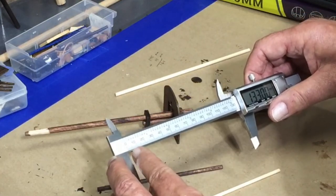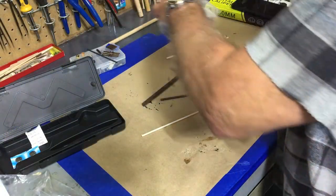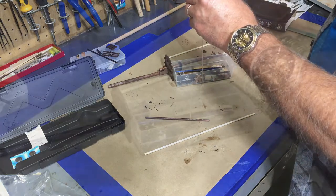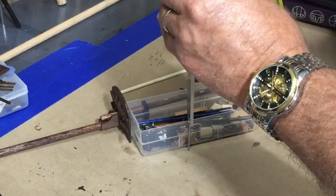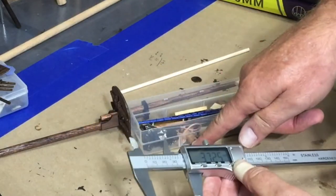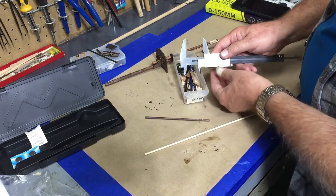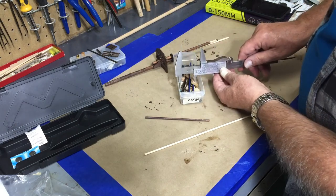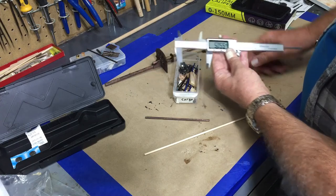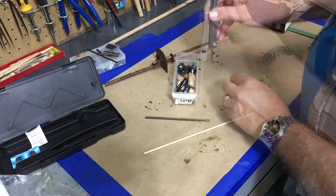The readings are easy to see — it gives the tens and at the top the single digits. The other thing you can measure is depth. As an example, if I wanted to know the depth of this, I take that down and lock this little nut in — 37.25 millimeters is the height of this little edge of this box. You can also measure interior width with these two jaws — sliding outward it's 50.55 millimeters. So you can do inside, outside, and depth.